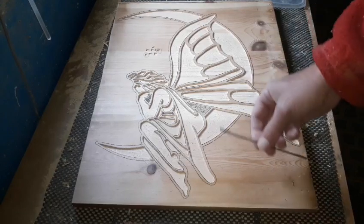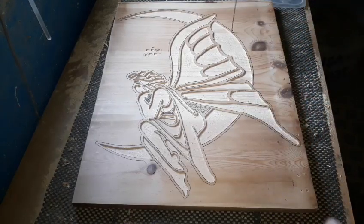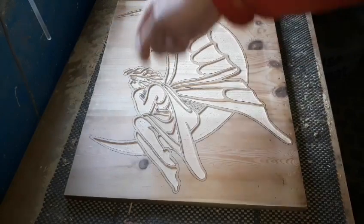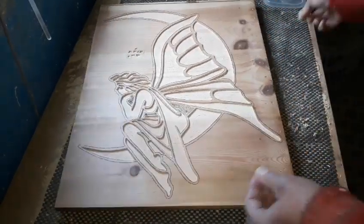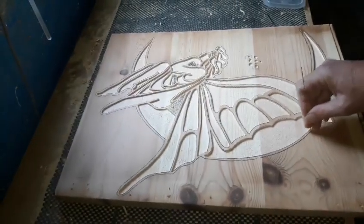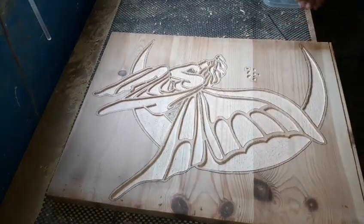So with these standard blades, you would have to have that in, let's say like that, and you'd cut that down towards you. Then you'd have to turn the wood, cut down there, and turn and turn and turn the full piece round to actually start getting along there. Whereas with a spiral blade, it will cut in any direction. So we could start with that on the saw, like so. We could start there, and if you just run that along there, all the way around, basically turning that wood.